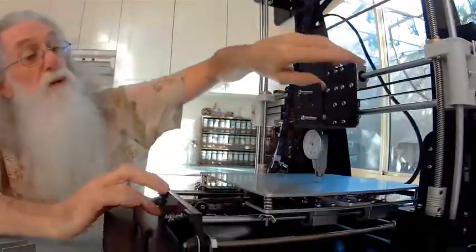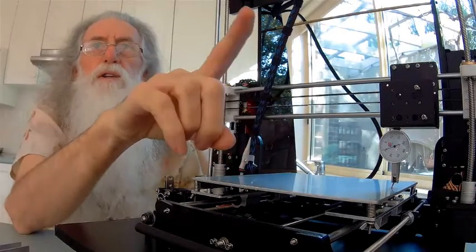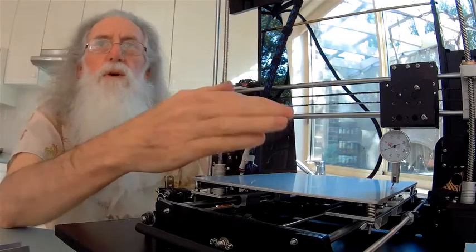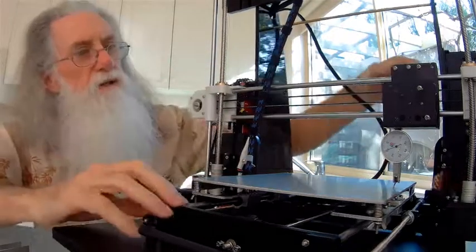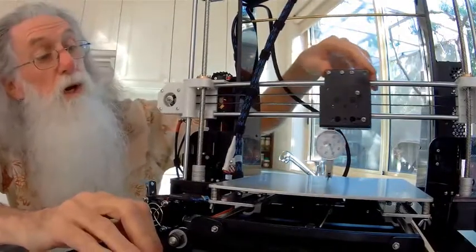So let's just see what it says here. Point 1. Whenever you set these gauges up, it's easy not to put them on 0, because it may go to 1 and go to 1, and when you look, oh yeah, that's still 1. It's not. So set them up, say 2 or 3, and then you know if it's 1, it's gone down to 2, and it's gone up to 4. So that's just a little trick for you. So we go across, point 1, 2.5, almost 1 again. So you can see it's point 1 of a dip there.